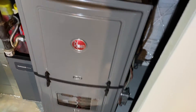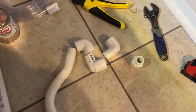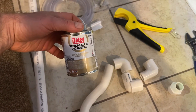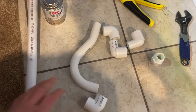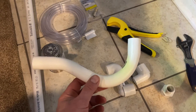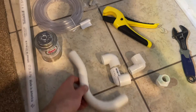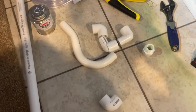The coil needs to drain somewhere, so here's what you need: three-quarter inch piping, different elbows depending on your setup, and a fitting to screw into the system. You'll also need cement — you don't need a primer because this is not under pressure. Some parts we're not even going to seal since we need to be able to open them to clean out the trap. If you can get a better trap, do it. Home Depot only had this one available, but it'll work — that's what it's made for.